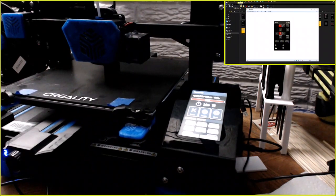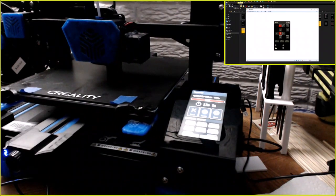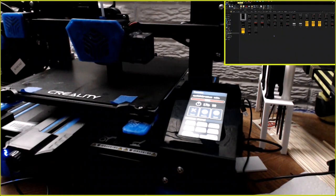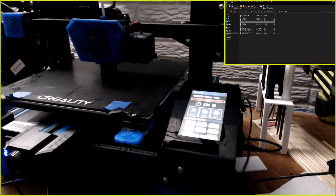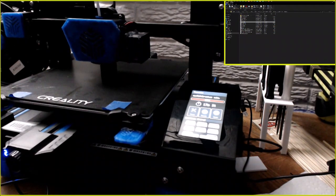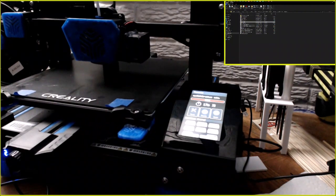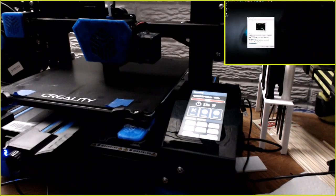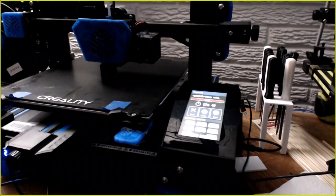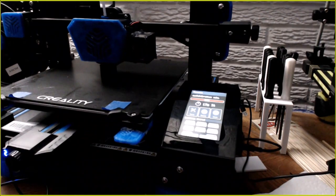Oh, here we go. See the X and Y? How these are in squares. And then you see over here on the main, they're all in squares. The bottom 2 are missing. And then these 3 aren't even there, and yeah, these are the wrong images. But I do know it is 23 screens, so I just have to extract the ones that are in it. Okay, so I just got to extract these, make the changes, and then make the image file, generate the file from those. So yeah, the mistake was not mine. I did do it right. The images on the card, or in the firmware, I didn't use the correct ones. I need to extract them from that 22 bin.